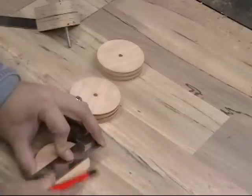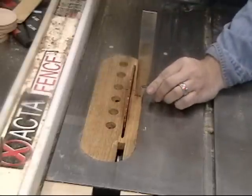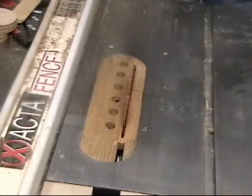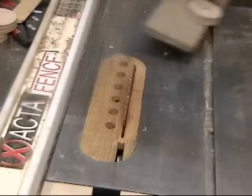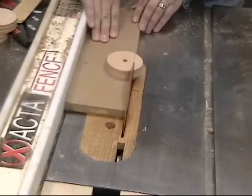Things like that require assembling things, then making your marks, then making your cuts to make sure everything works out just right. For this cut, double-check that your saw blade is square to the table. When you cut these pieces, you don't want to feed them through your saw by hand. Drill a hole in the center and screw it to a piece of scrap. This way, you make an accurate cut only through wood and not through fingers.